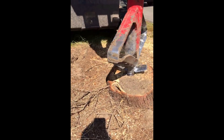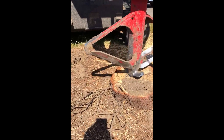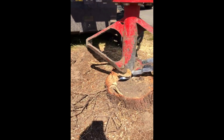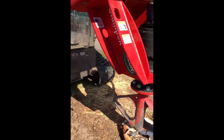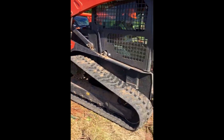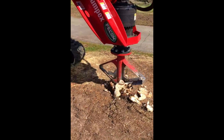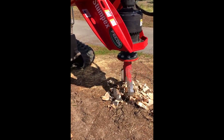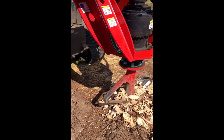So you need to be patient — a minute is only 60 seconds. As you see, you're starting to cut. The operator does not move the carrier whatsoever. The carrier stays still. You do not lift the machine up in the air. You let the Stump X cutter tool do its job — what it's designed to do — and that is slowly cut the stump in a safe manner.